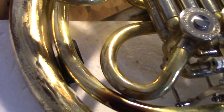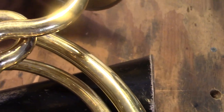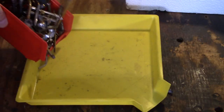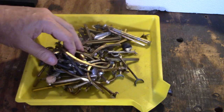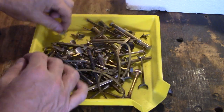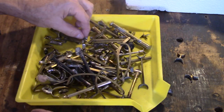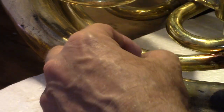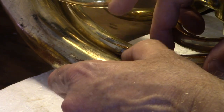I'm going to have to put a standoff brace here. A standoff brace is a very small little brace when two tubes are close together, and I think I'm going to have to put two on this side as well. However, after having collected about 60 French horns and taking many of them apart, I have a lot of braces hanging around — it's just a question of finding the right size and number. I'm going to start with just two standoff braces to begin with, once I have them soldered in place. I think I actually want to try the horn out to see if it sounds any good before I go to all the trouble to put all the braces in.